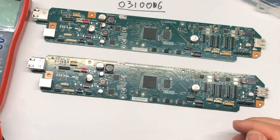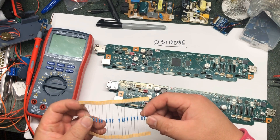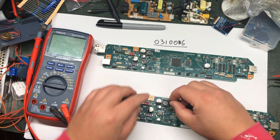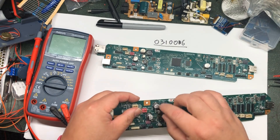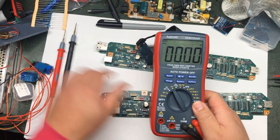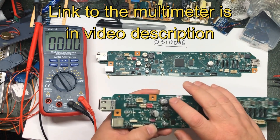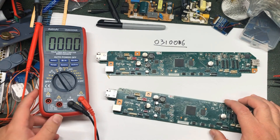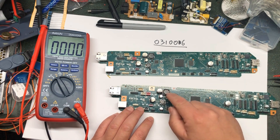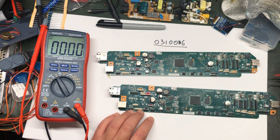Let me show you what you'd normally do with a multimeter. With a multimeter, you need to discharge the capacitor first — take a 20k resistor and short both ends to discharge the electricity. After discharging it, you have to remove it from the board, take it out, and put it in the multimeter. The multimeter may have a capacitor tester. It gives you the reading of how many microfarads it has. Then you compare with a datasheet and charge it to assess health. That's lots of steps, and removing components is just a nightmare. You cannot measure it in-circuit with a multimeter.